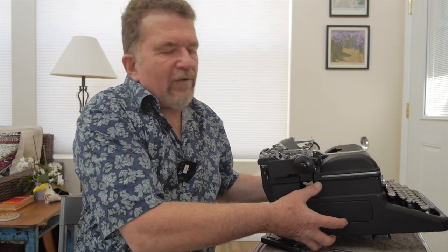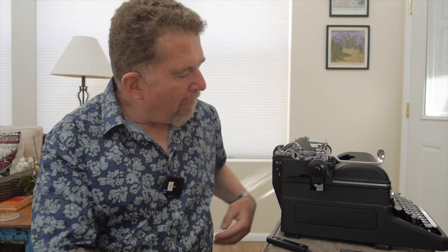There's another aspect to typewriter transportation: storage. Portable typewriters are fairly lightweight, but this typewriter is pretty heavy. One of the things John Lewis showed me when I first bought it is that the center of gravity is more toward the carriage in the back, so it's easier to pick up and transport this backwards — with the back of the typewriter toward your body. That helps with the center of gravity when carrying it. So I'm building this box so that the typewriter fits in backwards: the keyboard is toward the back of the box, the back of the typewriter is toward the front of the box, keeping the center of mass closer to me.